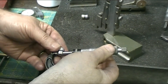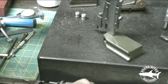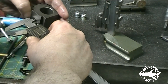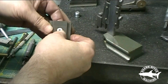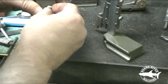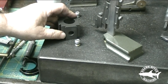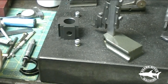The pins measure 442, which is not a standard size, and the hole measures 464 — so there's 20 thousandths clearance, and they've got a little o-ring on them that holds them in place. I'm going to drill it out with a 29/64ths drill which is 453 thousandths and try it out. If I have to open it up a little bit more I'll have to use a boring bar.